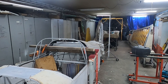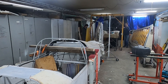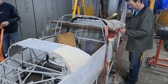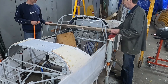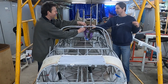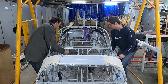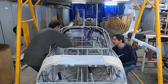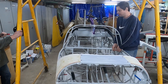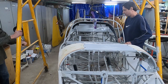Now that we have a new axle and a completely restored main wheel, let's mount it. The plane is currently resting on a block of wood under the mounting points for the main axle, and held upright by stands on either side of the fuselage. This means we have to bring in the crane to lift the fuselage up and mount the wheel. We put a strap through the fuselage, running over some strong points — such as where the tubes come together where the wings are attached — and lifted the plane off the ground. You could say this is the closest our Falcon has been to flying in at least 5 years.